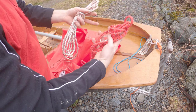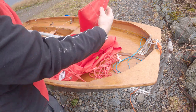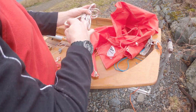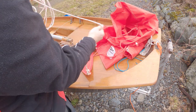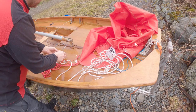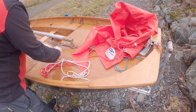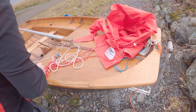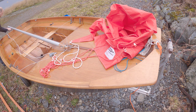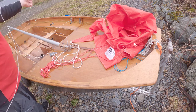Let's unfold the jib. This is why tying up your lines is so useful — these are tied up, which means they're a dream to get open. This is the halyard for the jib. All I'm going to do for now is put this halyard through the pulley so when we put the mast up we can grab hold of the halyard. I'm going to worry about the jib sheets in a minute. I'm going to cleat this off using the race cleat here, just to make sure it doesn't come out.